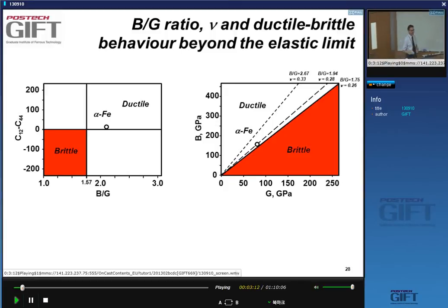All right, so that gives you an idea of, again, you're not testing the tensile strength, all right? Because you're bending the material, yeah? And they're basically collapsing, right? But it gives you an idea of what a few megapascals are if you were to do tests with your own muscle power. What a few hundred megapascal is, you can still bend this with your muscles. Over 1,000, 1,500, that becomes really hard to do.